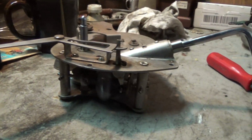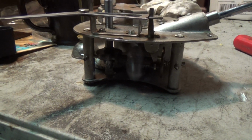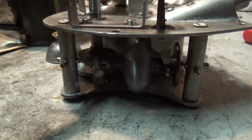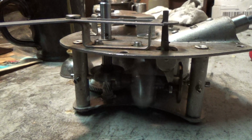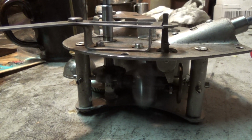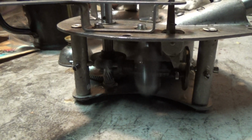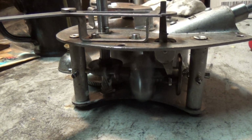And we're just playing it, well, no, we're not playing it yet. We're just running the motor to make sure everything's meshing like it should, and there are no problems I need to address while it's out of the motorboard. I always do that. Once it's in the motorboard, I'll play dozens and dozens of records, just to make sure everything's working the way it should and the grease is properly distributed in the spring barrel.